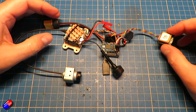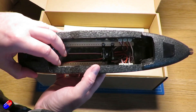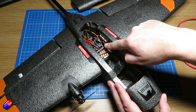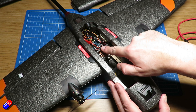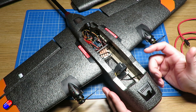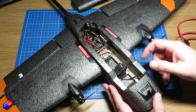In terms of the positioning of everything: when it comes out of the box, where the air unit is in mine is typically where the power distribution board is, which is right under where the central gravity needs to be. The CG is just about where the spar runs through - about five or six millimeters in front of it is the real sweet spot. So I had to think about how to do that. If the flight controller was here then I'd have to have the air unit behind it, which became a bit of a problem.